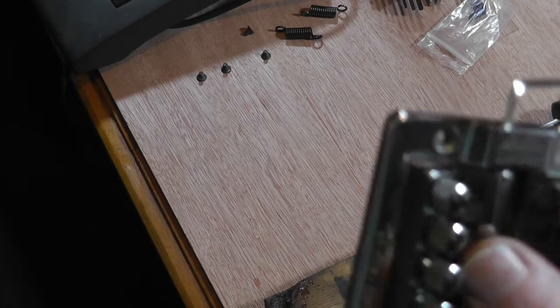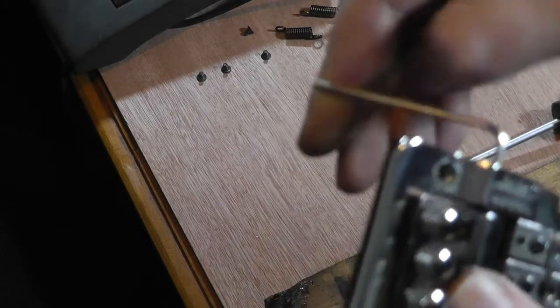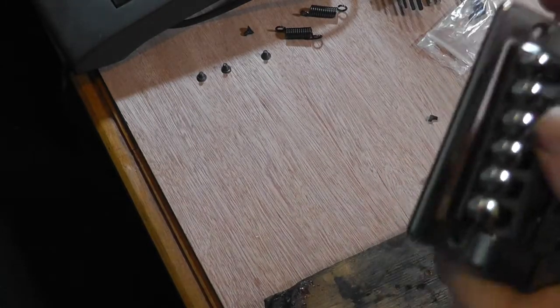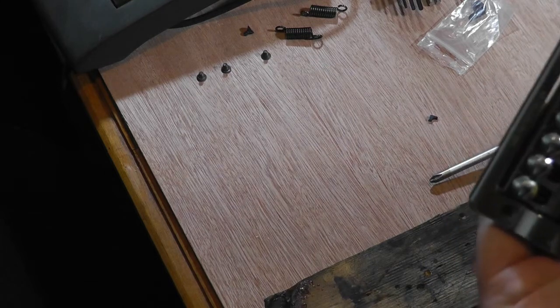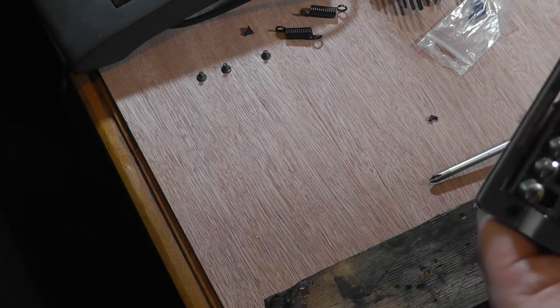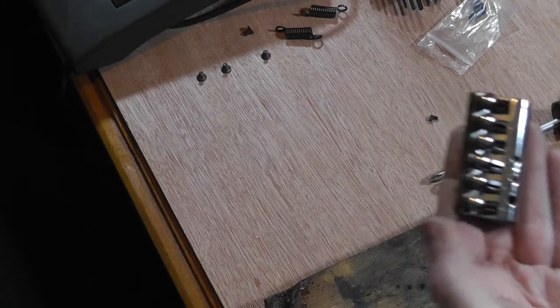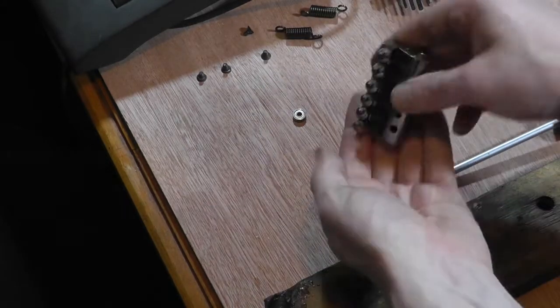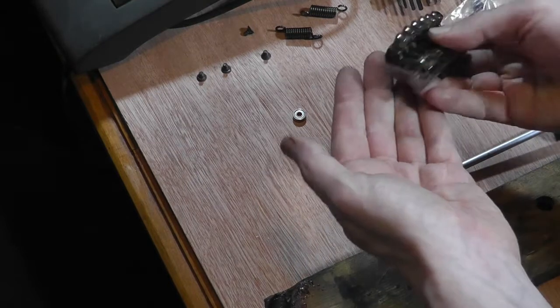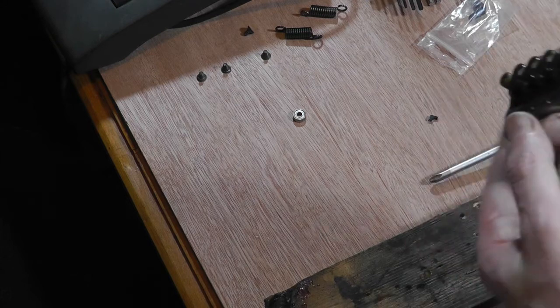I don't know if you can see that? It's the cam bearing screw. So we just wind it out until we've got sufficient clearance to move our cam out. Watch out for the bearings in the end of the cam. They might want to fall out. They don't want to fall out in this case, but well, one of them did. Okay, so